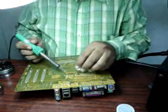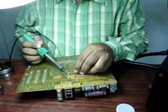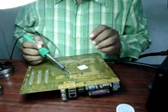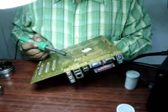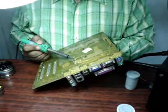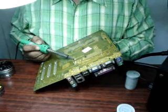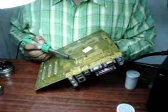Take a normal soldering iron and solder it out — add a bit of solder as if you are soldering, not removing. This is why I am soldering it out first. And thereafter, just hold the capacitor from the bottom, touch the iron to one of the legs and pull it, then touch it to the next leg and pull it — alternating between both legs repeatedly. Finally you will find the capacitor will be in your hands.